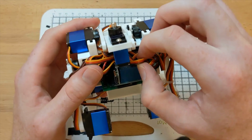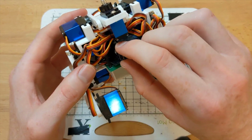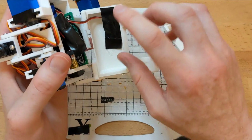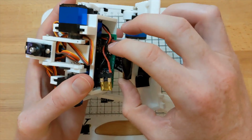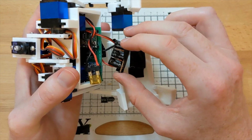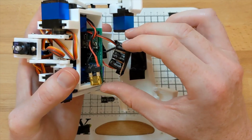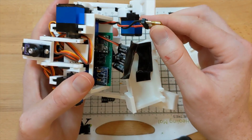This means you can choose which voltage you want to supply it with. Any of the options above 5 volts are sufficient and compatible, as the buck converters can handle up to around 20 volts. Disconnecting the front, you can see the voltage display and a bank of capacitors. This is to ensure that when the relay activates power to the servos, the supply to the Arduino isn't interrupted. This was a problem in the past, and this solution is a temporary workaround, but it seems to resolve the issue. There's also a fuse that will kill power to everything if there's a problem.